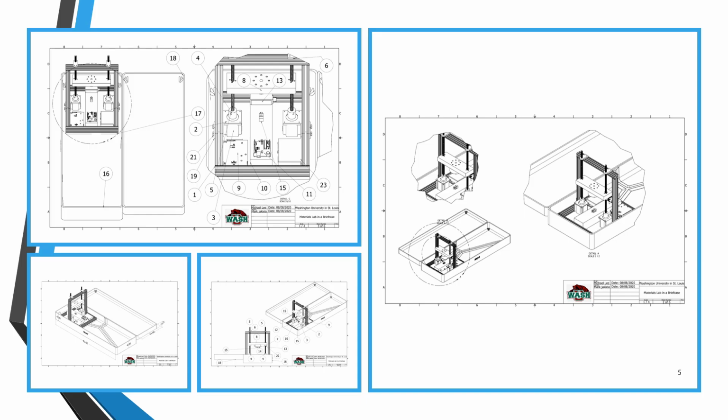So now moving on to some more detailed drawings that are ballooned out. You can see some of the parts that were shown. Figure balloon 8 in the top left corner. The balloon's basically showing the tensile tester cross member pieces, and balloon 13 shows the actual universal load cell. So basically this universal load cell would then send information to the Arduino, which would be balloon number 11. So we would run cables from 13 all the way down to the Arduino at number 11.